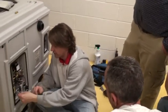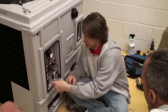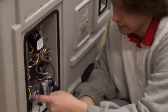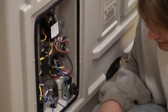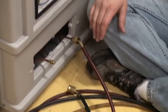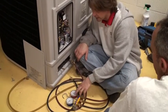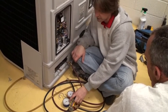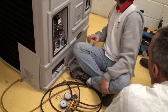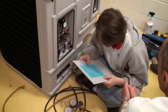If this was out of refrigerant because of a leak, you're going to go through your checks and say this thing is telling me there's no refrigerant because I've got 24 volts here and I don't have 24 volts. If you put on the gauges and they're at zero or at 20, it's missing refrigerant — you call them and they have to come out for a leak. You should see the refrigerant pressure equalize — I don't know if our team has a temperature pressure chart on the stack.